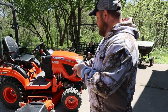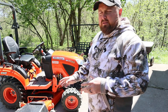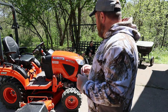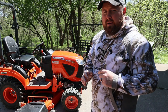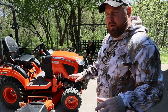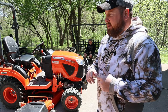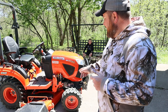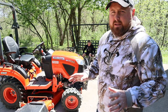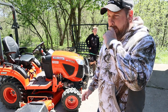The first thing I want to talk about is that mower deck. I'll link the video above showing me taking off this deck for someone brand new to the tractor - how easy is it to take off? The deck was really easy to take off. The problem I had was getting it back on during my cutting season. The problems I had were the front mounts. I did no adjustments to this mower - I literally got it from the factory in October, went through the winter, pushed snow, did yard work, used the front end loader, and when I went back to put the deck on it gave me a lot of problems. Mower decks give everybody problems - it's just one of the downsides of having a belly mower.